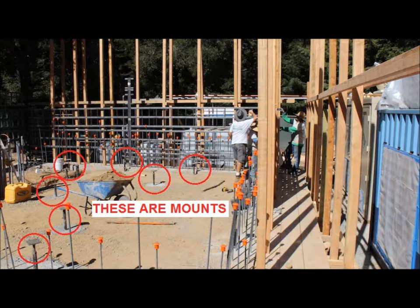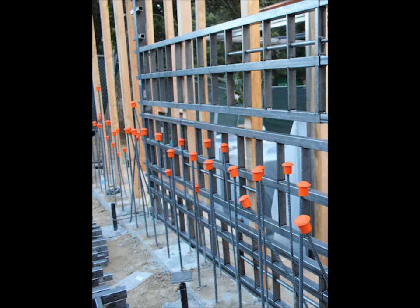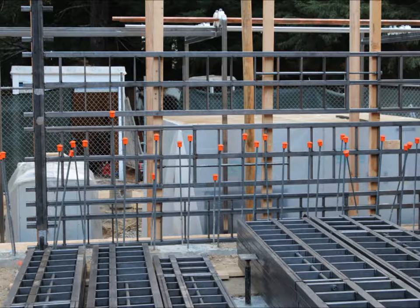After the mounts are installed, we construct the lowest section of scaffolding. The scaffolding is shot in with the survey station as well. The frames are referenced to the scaffolding and the concrete wall is referenced to the frames, so if the scaffolding is correct, the forms are correct by construction. This is an important simplification because it changes the installation of the forms from a complex fabrication process to a more simple assembly process.